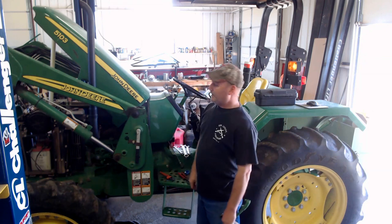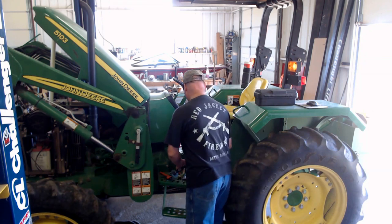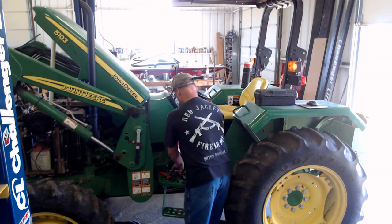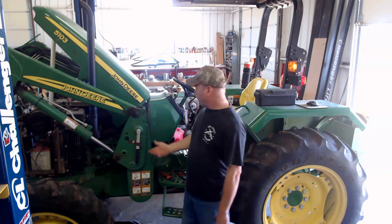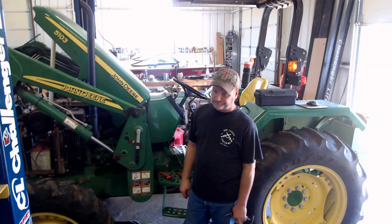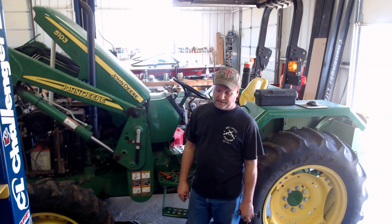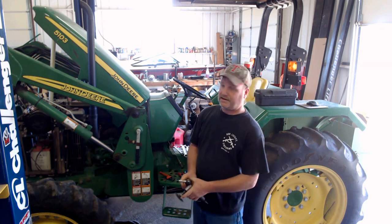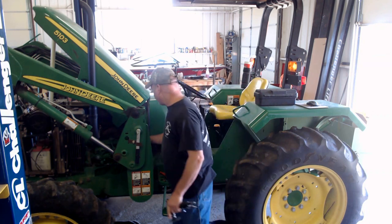So the next step was, how do you get, it had a big plug in the back that had a big 5/8 hex Allen wrench hole that you've got to take the old plug out of to put the block heater in. All right, well, that was a hassle. I didn't think I have a 5/8 Allen wrench, not even at work. And if I did, you can't get it in there anyway. Probably not very well anyway.